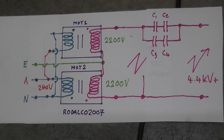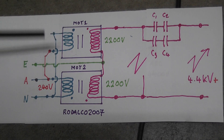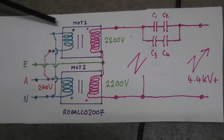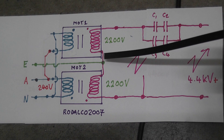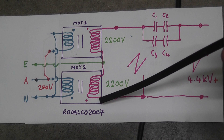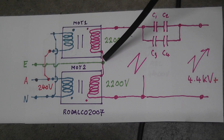I had to do a small modification of my drawing, as some subscribers commented — and they were right. I had the polarity dots wrong on the primary. As I said, the coils need to be opposed: anti-parallel, active neutral. So the neutral is on the outer and the active is on the inner, with polarity dots on the outside on the primary coil — that's a 240 or 120 winding. Because the HV winding is spot-welded to the metal casing, these windings go both in series but also anti-parallel, anti-series. Sparky Projects — another subscriber — also mentioned you can earth it, which is correct, so it makes it even safer.